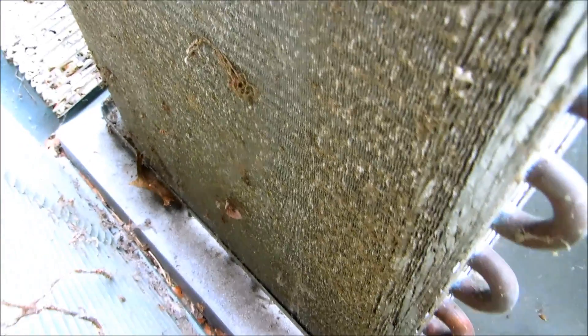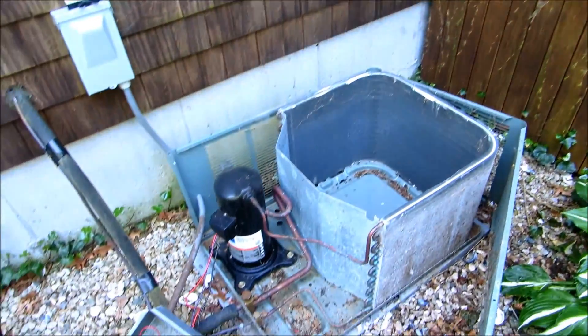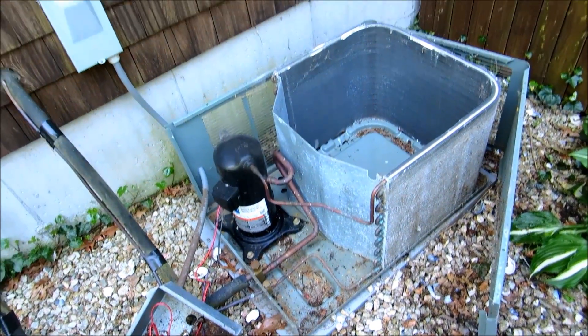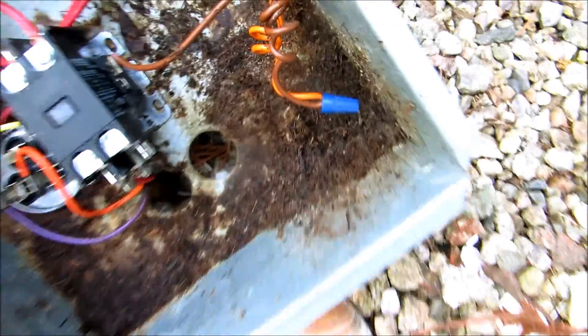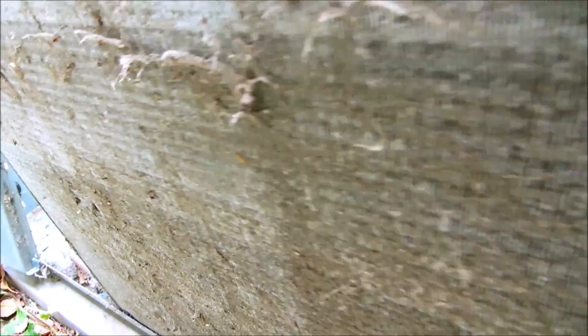Never been cleaned. I'm gonna take them both apart and clean them both good. This coil's pretty dirty too. I'll pull them both apart and clean them at the same time. Let the other fan out of there — Unico units inside are little high velocity systems. Mismatched equipment. I know he's running pleated filters, so we'll see what the suction pressure's like with them — probably not going to be good. The hell — mice have been living in there, a little fur and stuff. I got this all apart. Pretty dirty — I'll hit it with my brush.